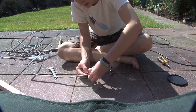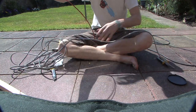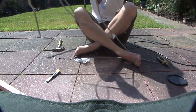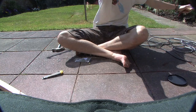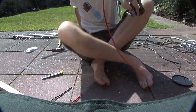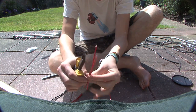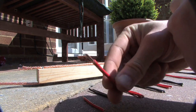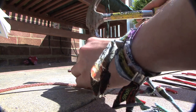Next we'll be cutting down the elements. I'm using 2.5mm cable here, but you can use coat hangers or anything that will conduct electricity. You can be creative with red and black colours. Cut your elements down to length — at the end of the video I'll give you all the dimensions and lengths you'll need. Then take the insulation off about a centimeter from all the elements, as this will conduct the signal you need.